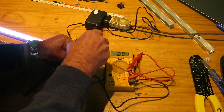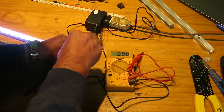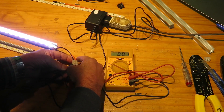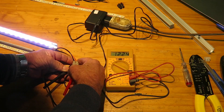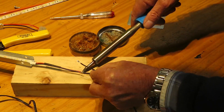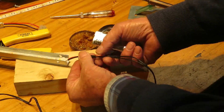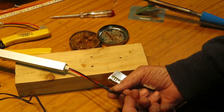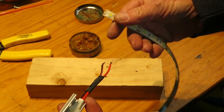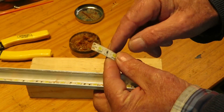According to ChatGPT, a 12-volt LED strip should work correctly between 12 and 14 volts, but its life expectancy can suffer at the higher end. According to LED salesmen, I must buy an LED transformer — the one they sell. So, we connect the wires and solder them together to ensure a good connection. We cover the joint with heat-shrink tubing and seal it with a lighter. When we buy a strip of LEDs they come with the ends already soldered to wires, but when we cut the strip, the rest will have no wires attached and we have to solder them. We cut and remove the silicone covering the copper contacts, use fine sandpaper to remove residues, apply flux to each contact and the wires, tin the wires, place them on the contacts, heat until the solder melts, then cover the end with a heat-shrink tube.